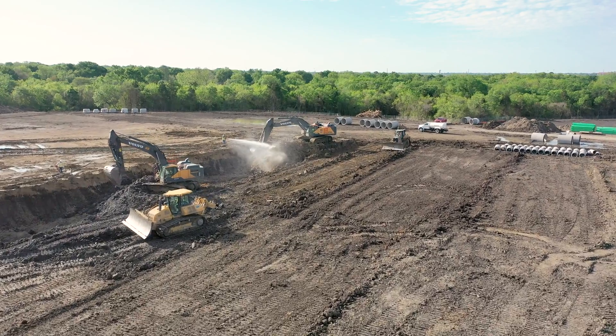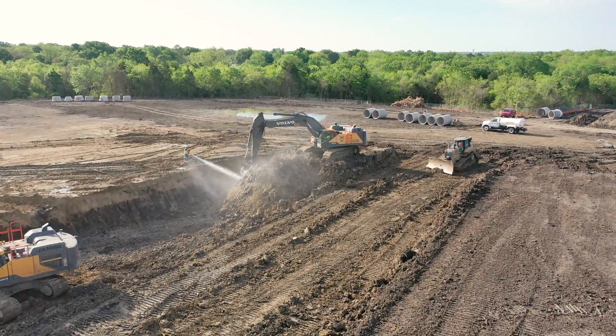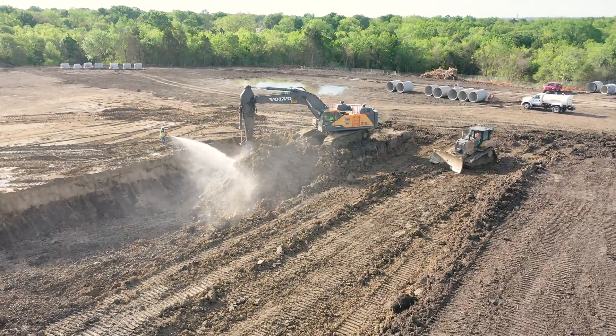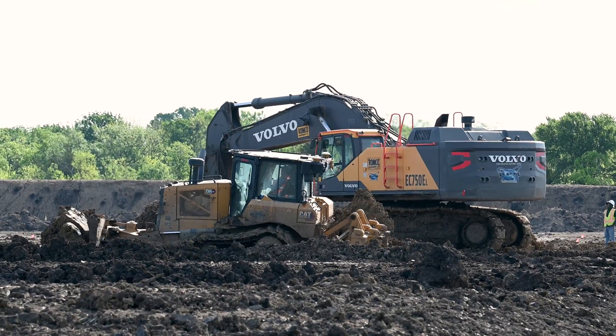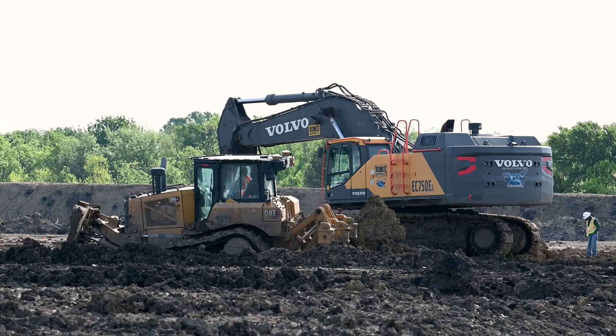So there are really three ways to mitigate that here in the North Texas area. One is to import actual quality soil as your pad. The second is the moisture conditioning pad — taking all your soil and mixing water into it and then compacting it to get your maximum PVR. Your PVR is going to be your potential vertical rise. That's normally within the range of 2 to 15 inches in this area, which is a huge change in elevation in your water to soil ratios.